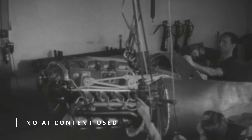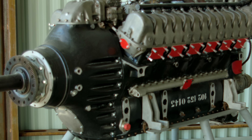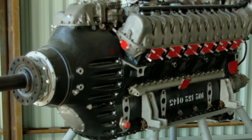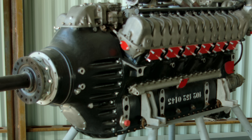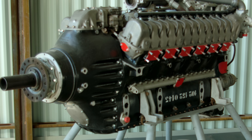In occupied France during World War II, Arsenal d'Aeronautique found itself building German engines under occupation, specifically the Junkers YUMO 213. That engine was a liquid-cooled inverted V12, about 35 liters, making roughly 1,750 horsepower at 3,250 RPM in its main variant.